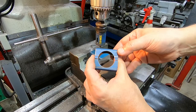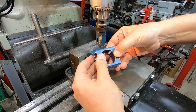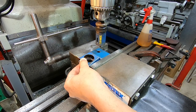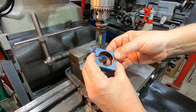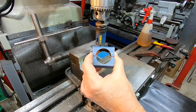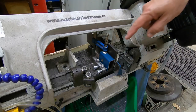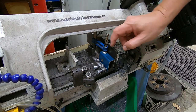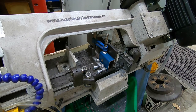Now I know the dust collection concept works, it's time to go back and remake a piece. When I made this piece originally I wasn't planning to actually use it, so I wasn't too fussed about how I did it — I had it clamped at a bias, which unfortunately allowed some distortion to creep in. The hole wasn't quite round and I didn't worry about it at the time, but after getting everything else sorted I thought I'd come back and make a better one. So I'm using a 35mm hole saw and then the boring head to open the hole out to 38mm. Cutting this short piece of tube was only possible courtesy of the horizontal bandsaw accessory I made — there's a video about that, it's proved very useful.